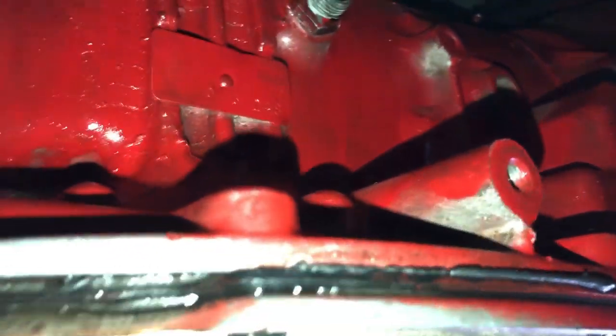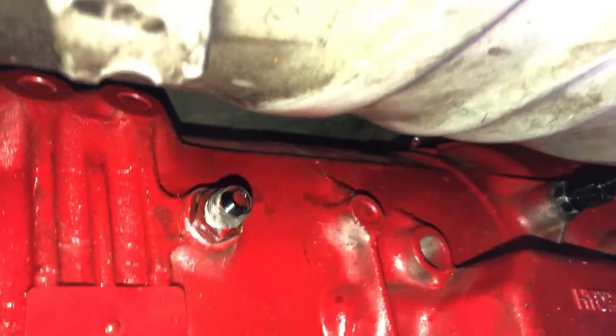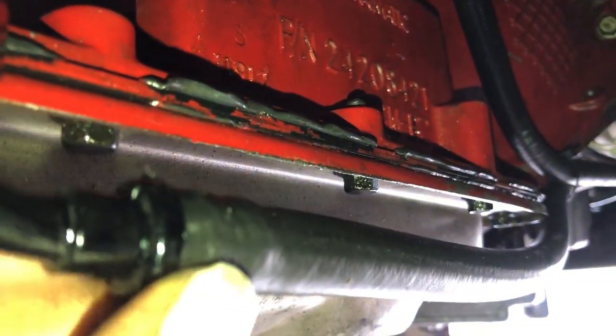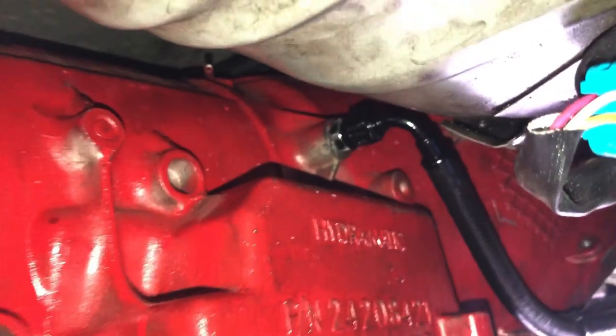Just to prevent any kind of leaking, use some Teflon tape. These things have hardly ever leaked, and if they do it's going to leak between the fittings — it's not going to leak anywhere else, especially if you put the hose on all the way flush like you're supposed to. Same thing, put Teflon on the ones on the back — those ones do have Teflon. If y'all haven't done so already, stop what you're doing right now and like the video — appreciate it.